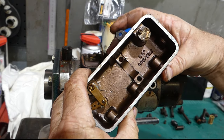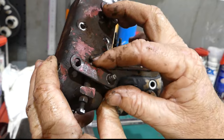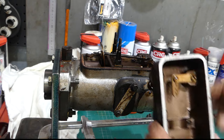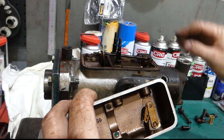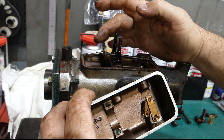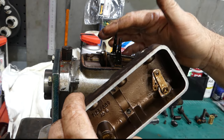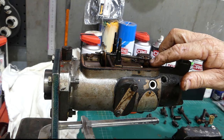Your stopper just pulls out and when you pull it, it pushes a little lever which shuts the metering valve off so no fuel gets past. The other spring puts a bit of pressure on the governor at the bottom — as the pump goes faster, the centrifugal weights throw out and adjust this. By pulling the throttle lever you put tension on the spring, making it a bit harder for it to work. That works this plate here — your main metering valve — which tells the pump how much fuel to put out.